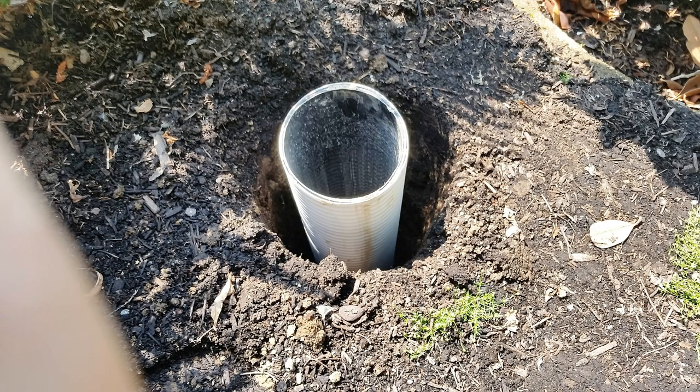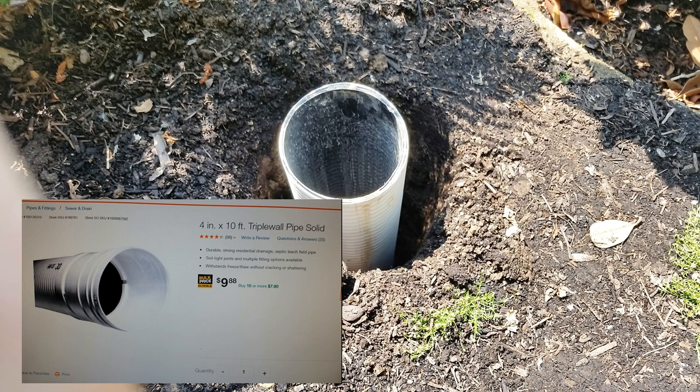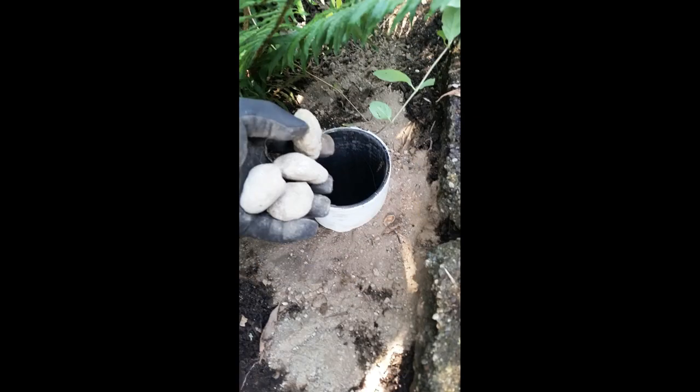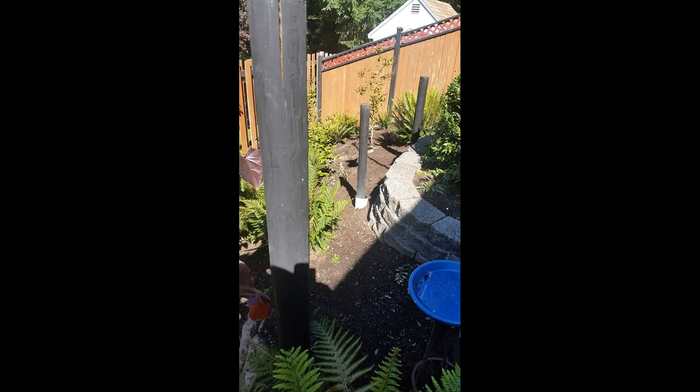Follow my link above for installing temporary posts into the ground. To make the posts easily removable from summer to summer, I added a pipe. Before backfilling the dirt around the pipe, make sure your post is plumb in the vertical position. Throw a couple small rocks into the pipe — this will keep the end of your post out of the dirt. Since your poles are 10 feet long, you'll have 2 feet in the ground and 8 feet above ground, giving you more than enough headroom for people to walk underneath your shade tarp. Since the poles are removable, you can remove the tall poles in the winter and put in shorter poles for other projects. Now that your poles are installed, head back over to the house. Along the eave, you want to install eye hooks — this will give you the second side of tie-offs you'll need to install your shade.